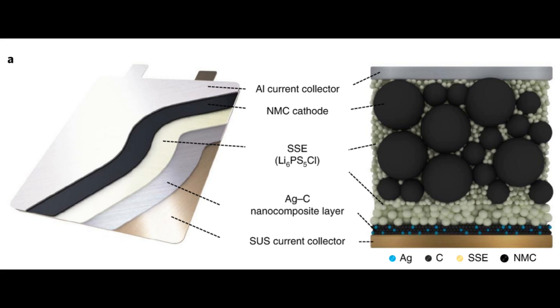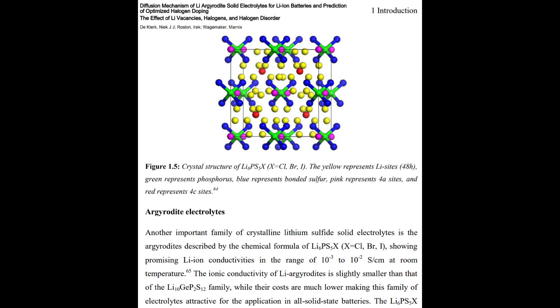Instead of a liquid electrolyte, the Samsung cell uses a solid electrolyte, shown by white spheres that vary in size between small and medium. Some solid state electrolytes, such as the one chosen for this research, also help prevent dendrite growth, because the solid electrolyte conducts lithium ions in a way that distributes them evenly during lithium plating. The solid electrolyte the researchers chose is a chemical compound high in sulfur, so it's classed as a sulfide solid state electrolyte. Sulfide solid electrolytes have high lithium ion conductivity at room temperature. More specifically, they picked a crystal structure called argyrodite that has slower reaction speeds than most sulfide based solid electrolytes, which is a drawback for charge and discharge rates. However, because it's less reactive, it's much more stable when it touches lithium metal, making it a great candidate for a lithium metal battery.